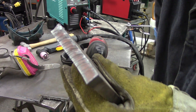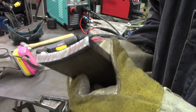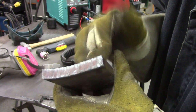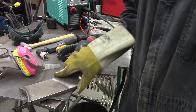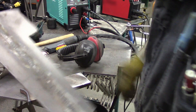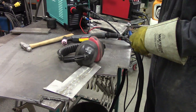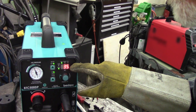Wow — half inch! I pretty much never cut half inch and I'm impressed. The last plasma cutter I tested could not do half inch — this cut half inch. Holy crap, that's cool. What about something thin? This will probably be 18 gauge. And I just noticed I cut half inch on setting 35.